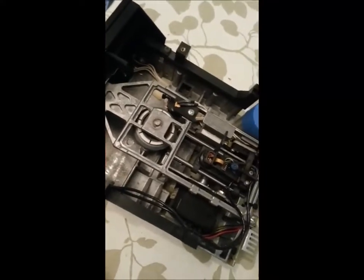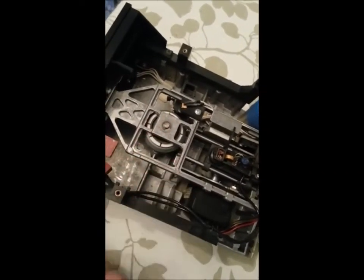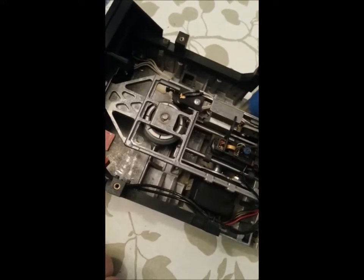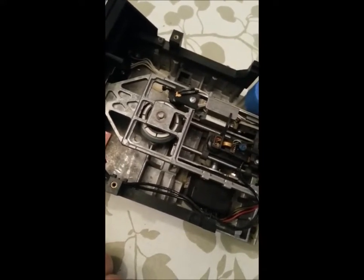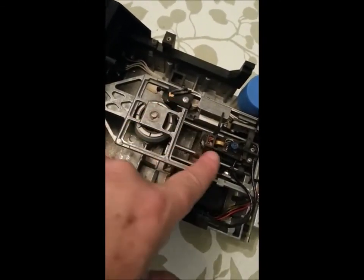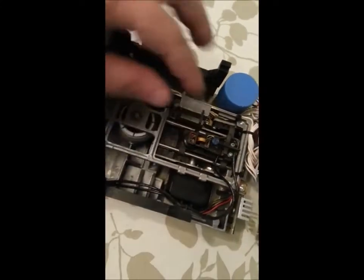That is a critical piece that sets up the timing for the disk speed. There are utilities you can use to check — these drives should run at around 300 RPM; they shouldn't be running at 250 or 230. They have to be very near 300 in order for the timing to synchronize with the head read/write.